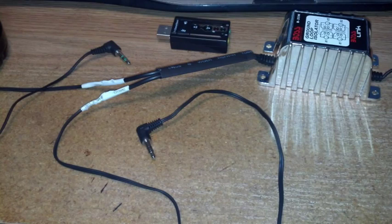Here I went ahead and put the other side in. I went ahead and heat-shrunk the mic positive and the headphone outputs, which are going to plug into the USB sound card up on top. This is all going to go on the Raspberry Pi. It's now audio isolated and the cable is shielded so they won't short out. Here's the finished cable — I slid another piece of heat shrink tubing over it just to finish everything up and make it tidy. It also gives strength to the connections. We're dealing with very thin and very weak wires, and we removed a lot of the fiberglass strength filaments inside the cable, so I replaced the strength with two heat shrink tubes — internal and external.